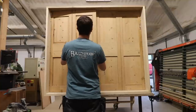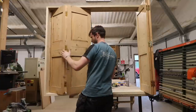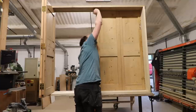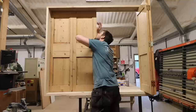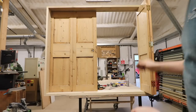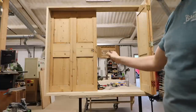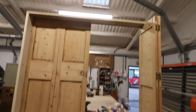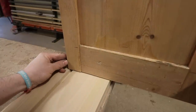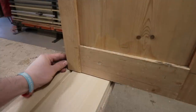Looks like it might be a little bit big. When I straighten the two doors out, it is the lines that I mark off the edge of the door. Exactly the same for both of them. If I take 1 mil off each shorter door, it will help me with this little bit here. So when I set the door at 90 degrees, if I take a mil off the shorter door, it'll bring this door back this way, another mil.